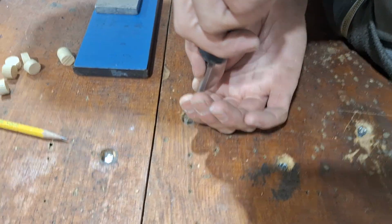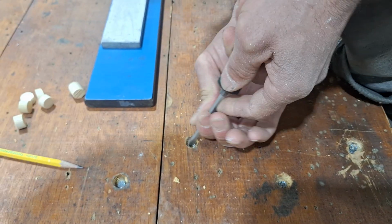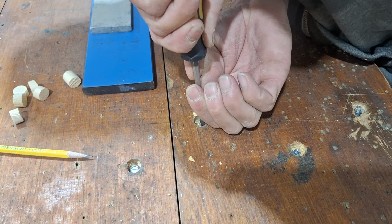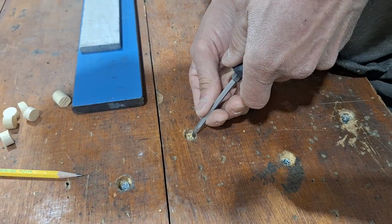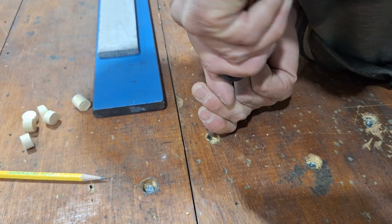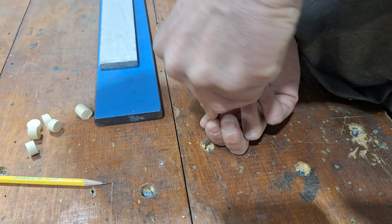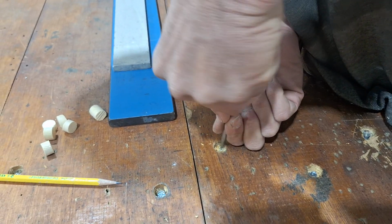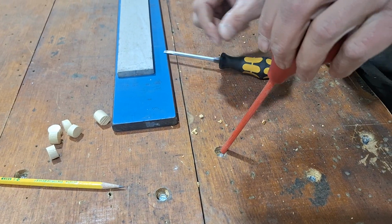So what we've got to do is there's old glue in every hole that we have to dig out from when the original plug was installed. And the problem is, it would be nice to use a drill bit or something, but at the bottom of every one of these holes is a screw, so we were concerned that we'd probably toast the drill bit if we actually used a bit.